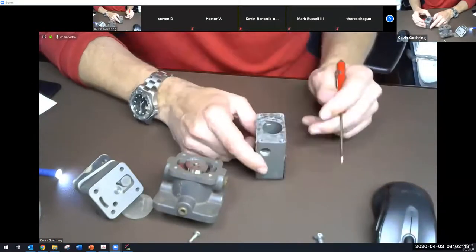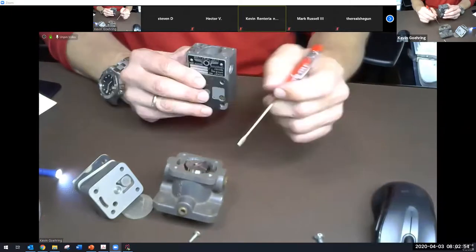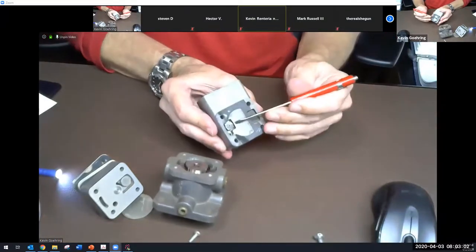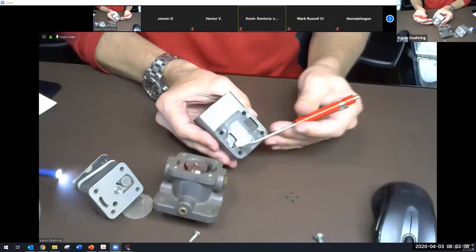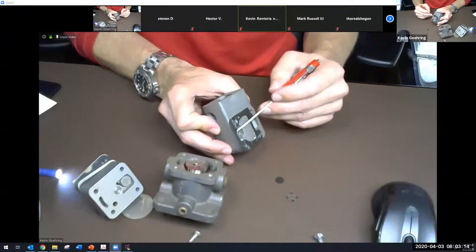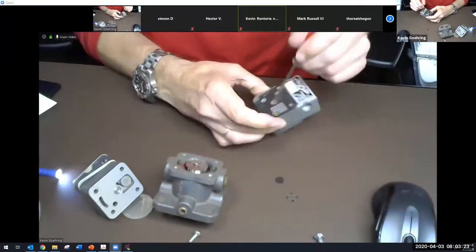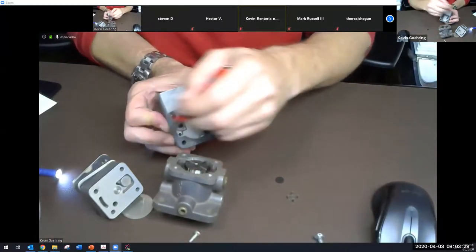If it's in bypass, what happens is fuel comes through here and goes through the swirl chamber. Of course it tries to go through the pump, but it can't. So it goes through the swirl chamber, and then there's another little passage inside the swirl chamber right behind this. This is a check valve. I'll pop it apart. It's missing a spring, but there's just a little cover right there. Covers off. It comes out of here, so it presses this little button open, and this is where the backside of the pump is. So fuel will come out of this way from the boost pump and either go into here, back through that little orifice, back through the relief valve, or here out to the fuel control unit.